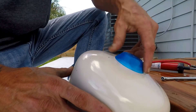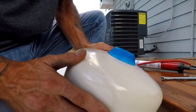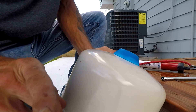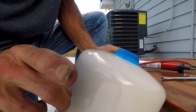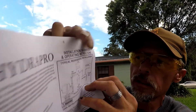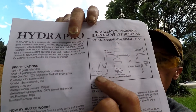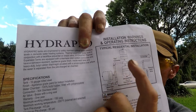Use your bicycle pump to bring the tank up to 50 PSI. Take your tire gauge and test the pressure on your tank — 50 pounds. Reinstall the cap on top of the Schrader valve. Now you're ready to put this on top of the water heater where it's supposed to be, because now the tank is charged at the same PSI as the incoming water pressure from the city. Some local municipalities may require you to install an inline check valve before you reach the thermal expansion tank, as shown on the diagram that came with the tank.